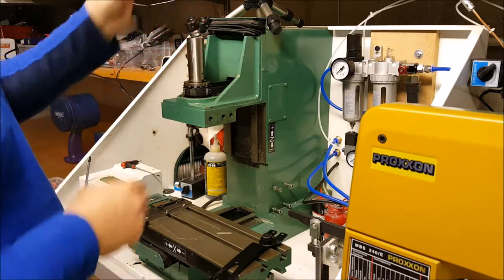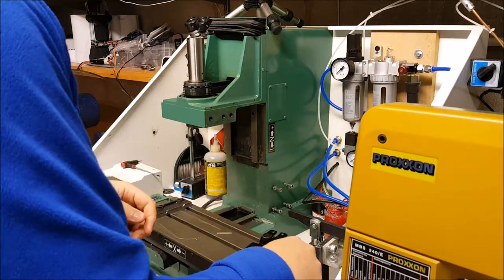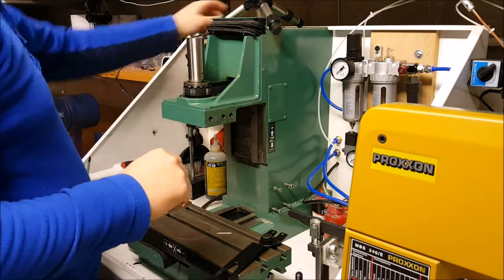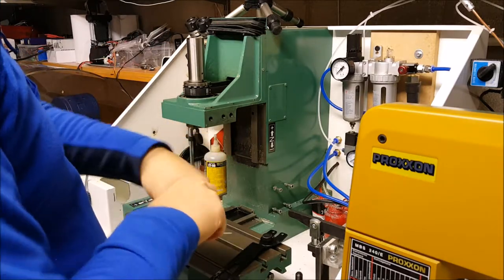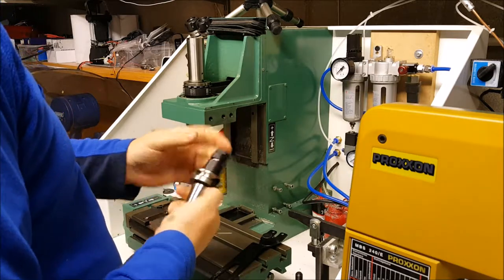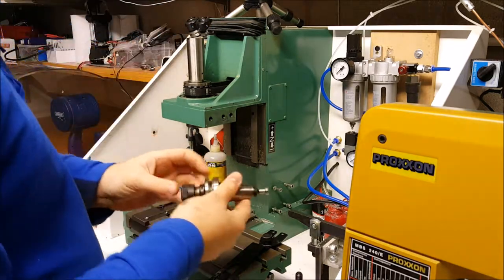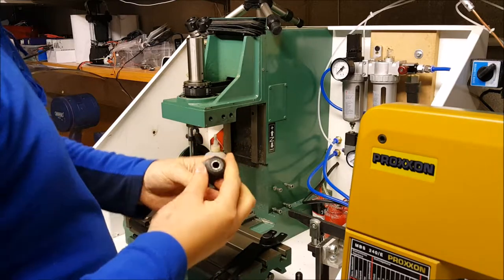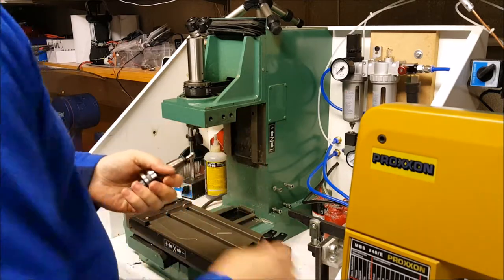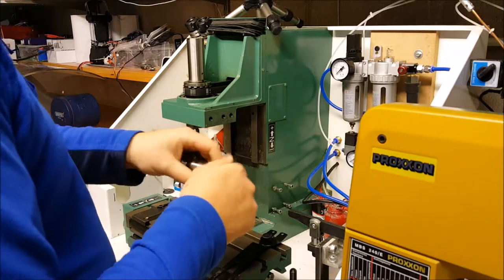What we're going to do is replace this with something that will grab hold of BT-30 tool holders. This is an ER-16 one with a bit of a shoulder on it — with extensions. I prefer the shorter ones because you get more clearance from the tool; you just put collets on them and there you go. That and that are different, so that would normally just bolt in the back and you could use those as they are — I'd have done in the past.